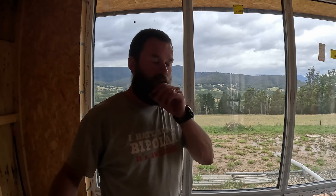We had a good day today — we got in another one, two, three, four window frames. We've glazed two of them already and we've pretty much glazed a third. They are hefty — the frames are solid by themselves but not too bad to lift. The glass is 40 kilos per square metre, so really happy with the way everything went today.